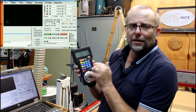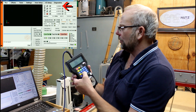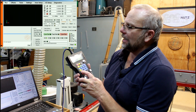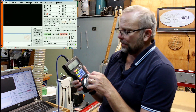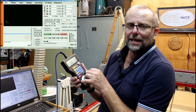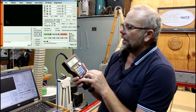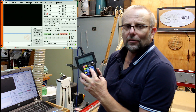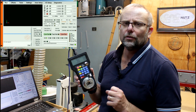There's another button that zeros the machine coordinates. I've also programmed three macros to zero the X, Y, and Z working coordinates individually. There's a step button that cycles through the different step values: push it once for single step, again for ten times the rate, again for a hundred times, and again for a thousand times. There's also a zero button that zeros all working coordinates at once, not just one at a time. I still have two keys I haven't decided what to put on yet.